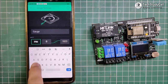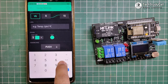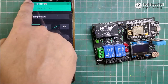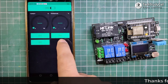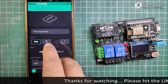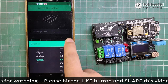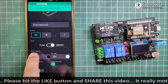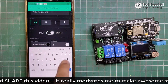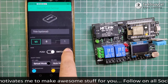I will tap on the second gauge widget. Here I will type temperature. And in the pin, I will select virtual pin 6 and set the limit 0 to 50 degrees Celsius. Here I will type the degree Celsius sign and also change the color. Our second widget is also created. Now I will add three style buttons which will act as switches to control the relay module. I will tap on the first style button, which I will use to select the mode. So in the pin, I will select virtual pin 3. The mode will be switch. When it is 0, it should be in manual mode, so here I will type manual mode. And when it sends 1, it will go to auto mode, so here I will type auto mode. I will change the color for auto mode and manual mode. Now our first switch is created.